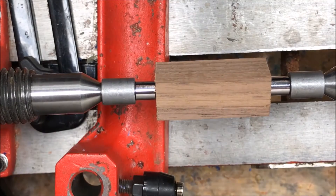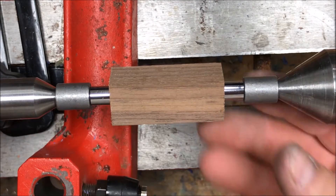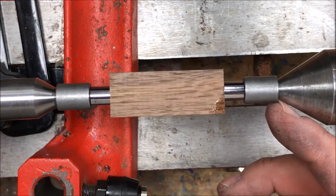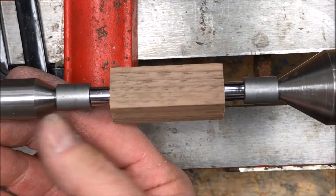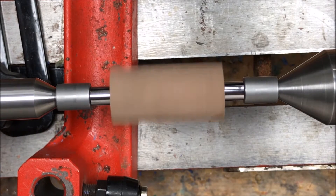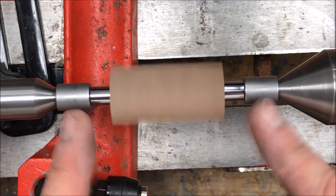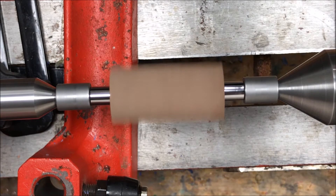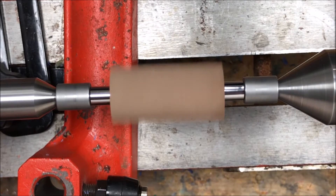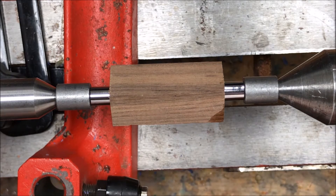I've got everything locked down really tight. I'm going to slide the lathe just a little bit so that you can see and make sure everything is in the frame. I've got a nice tight fit on my 60 degree live center and a nice tight fit on my 60 degree dead center. Everything appears to be lined up. I'm going to turn the lathe on at the lowest possible speed and I don't notice any movement or vibration on these particular bushings. Let's give it a little bit more speed - it seems to be operating very smooth. I'm going to get my dust collection system set up, bring the tool rest up, and we're going to turn this blank and see what happens.